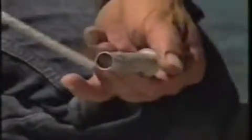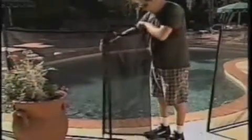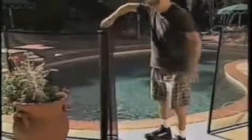To install the sleeves, apply a small amount of epoxy evenly. Then, insert into place. A gate can be placed anywhere 2 panels connect. Simply drill an extra hole on the pool side of the fence 3 inches from the next closest hole. Place the fence into the holes. If you need to fabricate any custom length panels, now is the time.